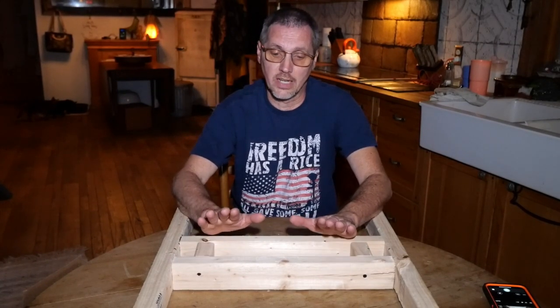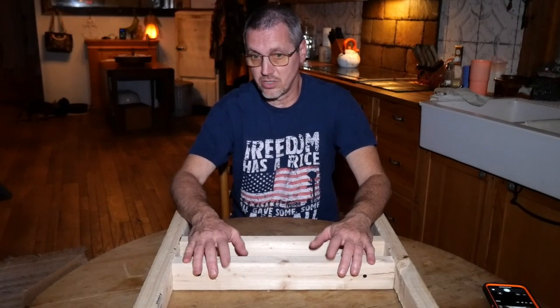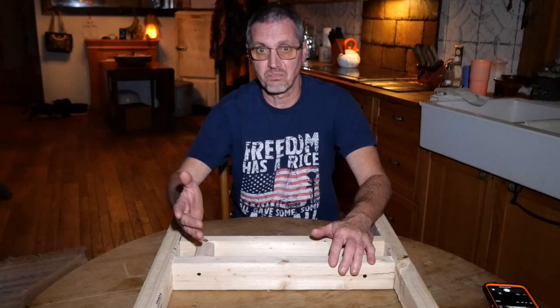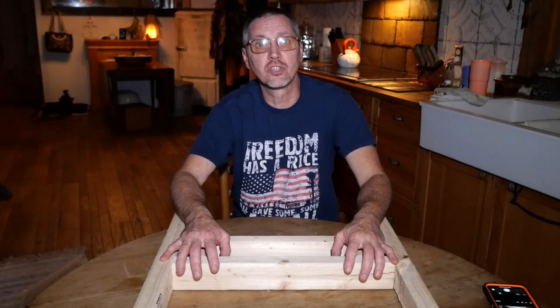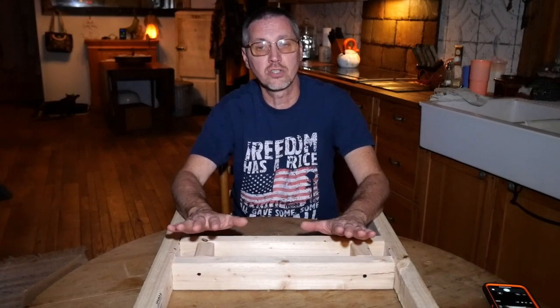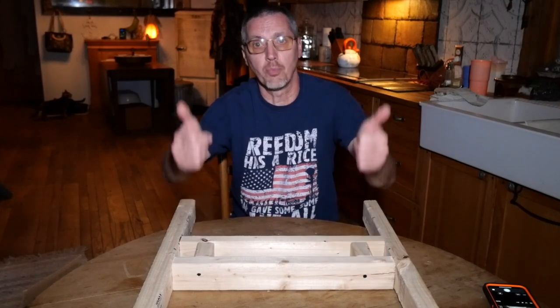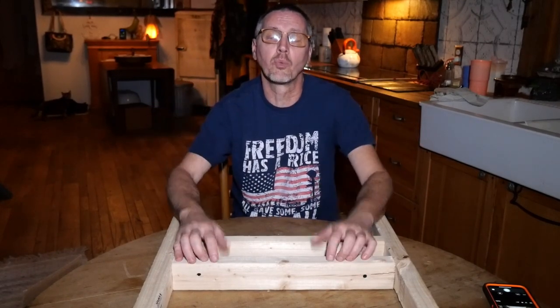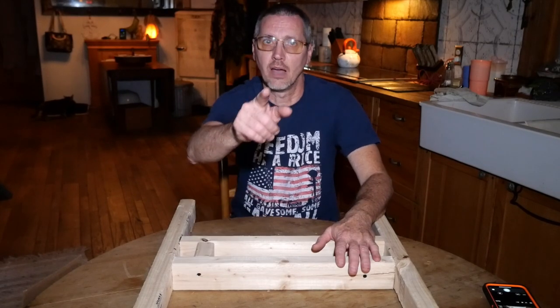So I hope you enjoyed this video on making cheap and easy target stands. These 2x3s were less than $2.50 a piece, and it only takes six 2.5-inch screws, so they're real nice, low-cost, cheap stands. And if you want to, you could cut your uprights longer, but then it would require three boards. Thanks for watching. Hope you enjoyed, and you have a good day.